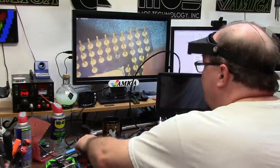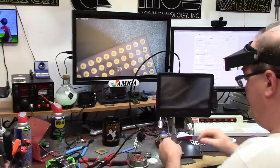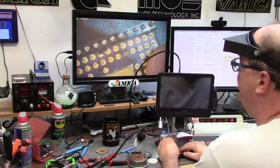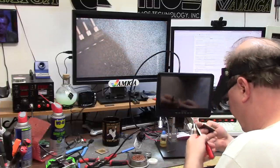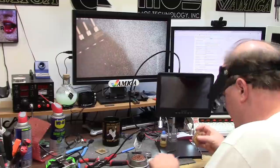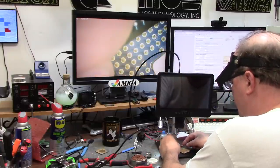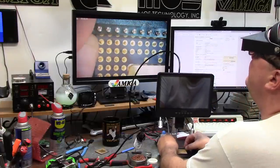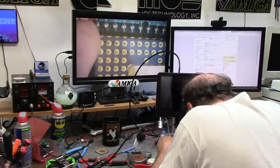Now, they're still crooked. The idea is I'm going to use a header like this. Ow! That's hot. I'm going to use a header, look at the TV screen, and go over each row. Now it is the same spacing, so once I get these relatively bent in the general direction, I can then put this over top of it here. Remember, I extracted one pin like this and move them to the appropriate place. Okay, so I have to do that 208 times.